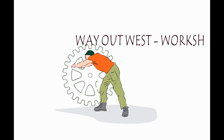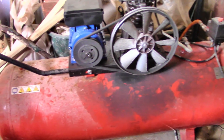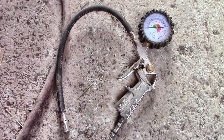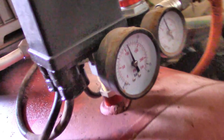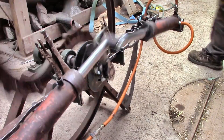I was doing some experiments on my engine this week, wondering whether I could power it with compressed air instead of steam. This is my normal air compressor — it runs my plasma cutter usually, but I can pump up the tyre on a wheelbarrow with it too, or connect small workshop tools like a stapler. It's a 200-litre tank, pretty big, but the pressure inside is quite low, only around 100 psi — pounds per square inch. It will run my engine for about 5 minutes, so I wouldn't get very far if it was powering a locomotive.